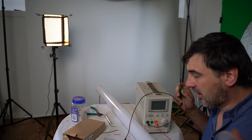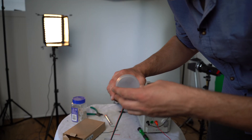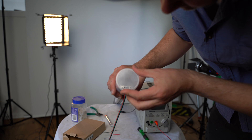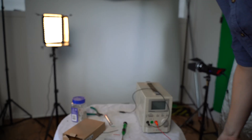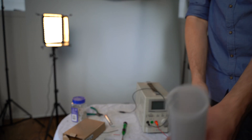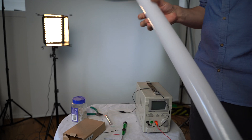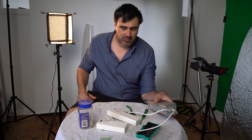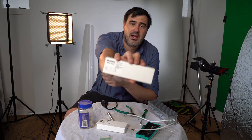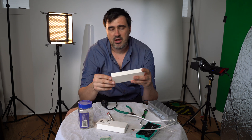Now that we've tested it, I'm going to add the end caps to the tube. And there we go — we have a fully self-contained tube that has a cable running out of the back of it. Now what we've got to do is connect our controllers. We have a 12.5 amp output at 12 volts DC power supply going to a constant voltage four-channel dimming and colour temperature controller.